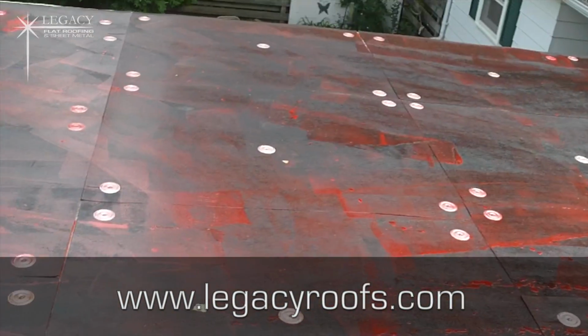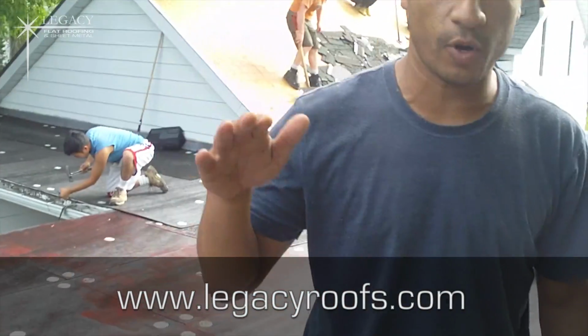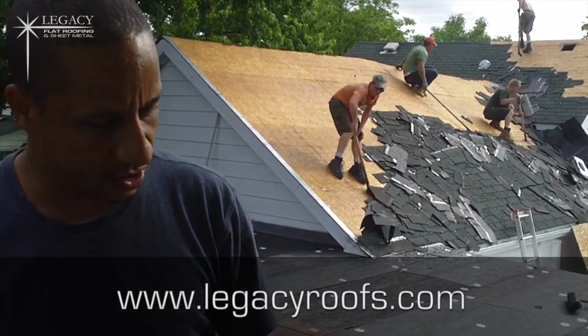We're cutting off the old roof, giving a nice clean look. When we're done, we don't want the old roof exposed under the metal flashing. And so that's it. We're going to start putting ice and water shield down when the primer primes. Put some ice and water shield down on the shingles, and start doing some detailing. Show you what it looks like later.